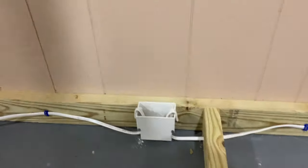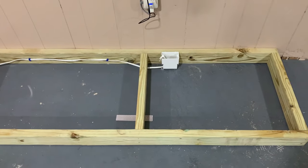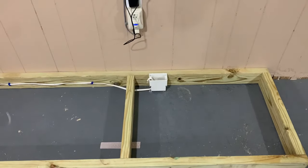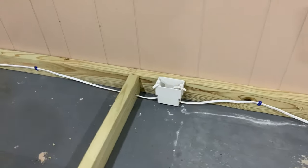We just go from junction to junction, and each one is obviously going to support two arcade one-ups. You've got about four feet and then that outlet in the middle, so you can plug into each outlet. The junction boxes are also fiberglass — I would recommend not using steel because if it does get wet down here it could rust.